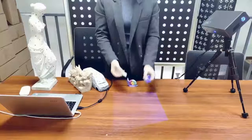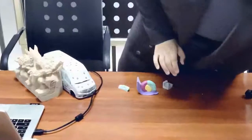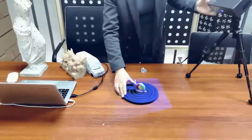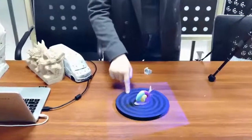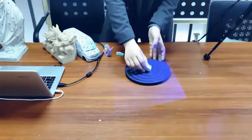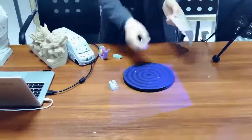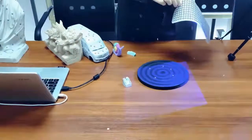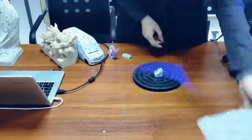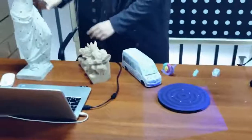Then we also tested some small objects: a 10 cm snail, a 3 cm industrial part, and a 5 cm tooth mold. Remember the hand turntable we saw in the box? The snail can be feature aligned. And the industrial part: stick marks on the turntable and do mark alignment. Please stick more than 5 marks, for the system requires over 4 marks for every single frame. So do the tooth mold. Now from 3 cm to 60 cm, let's go for it.